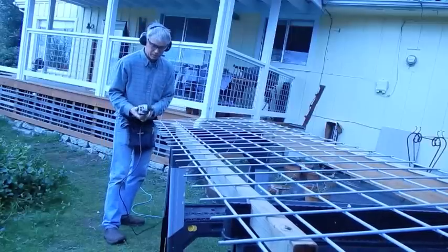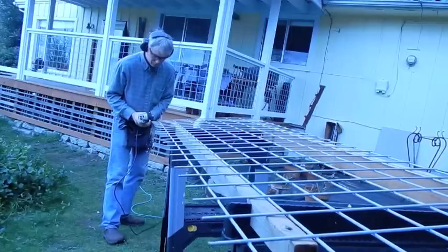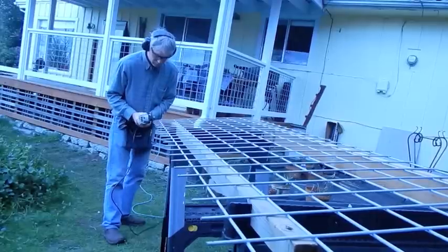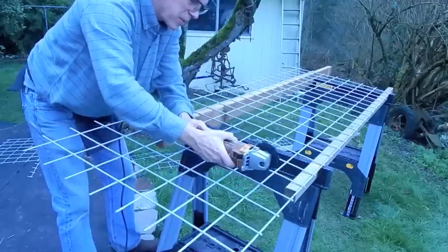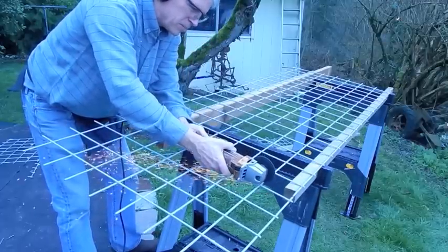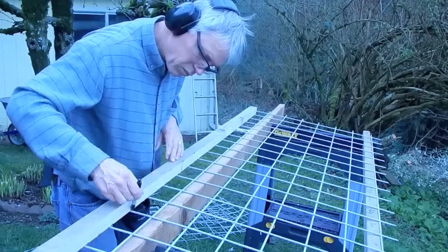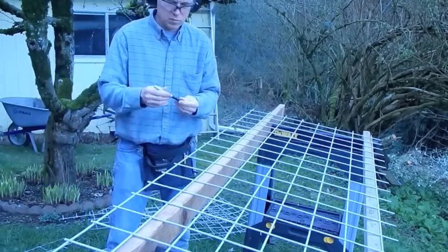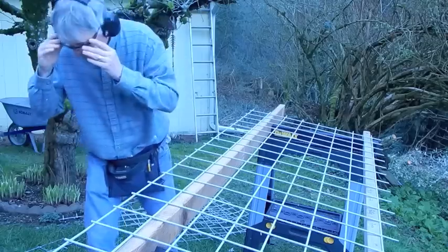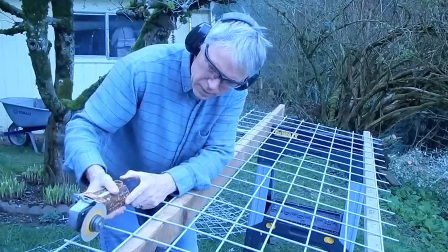I thought I'd mention that Hog Wire Railing is an outfit that has distributors all over the country. They sell panels in 8-foot by 3-foot and 6-foot by 3-foot sections that are black powder coated and silver powder coated — four times the cost, but for a better look, check them out. To get my panel height dimension, I went ahead and added the two grooves together and added 26 inches, then subtracted a little bit for clearance.